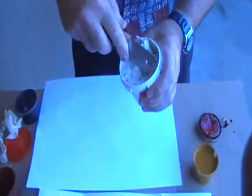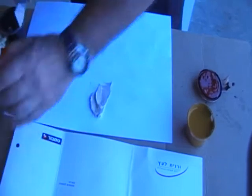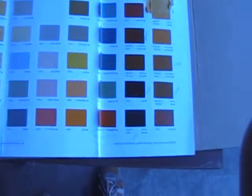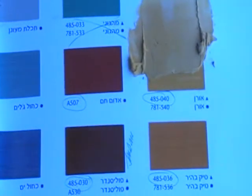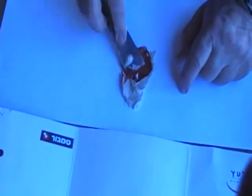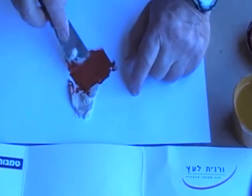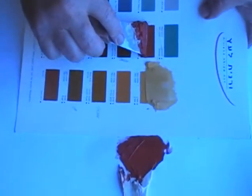It's nice and soft again. I'll take out some putty and I'm now going to make the color. Remember, we're still using the natural Timber Mate putty. I'll make color A507. To make A507, I've taken some of your F colorant. This color is very, very strong, so all we do is mix in the colors. It's easier if you keep a record of how much you're using. As soon as you add the stain, the color of the putty changes. I just need to establish how much to put in to match that color — and I don't think I'm too far away.